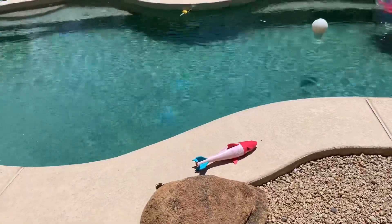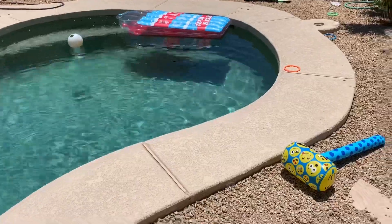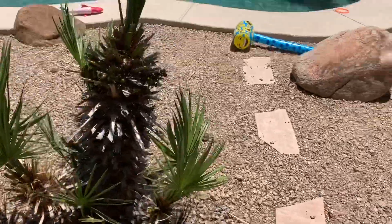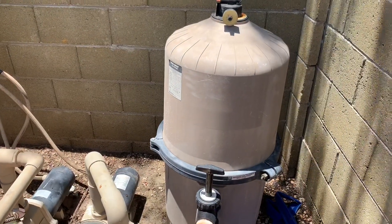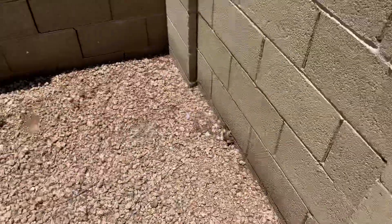One other thing to mention: when you do this, empty your baskets too. Start fresh — clean those out, get everything as clean as you can. Open up your in-floor vacuum system valve if you have one — not everyone has that. Just clean out everything as much as you possibly can. I'm going to go ahead and turn this off — it's been about 20 minutes so we should be good. Ideally clean everything as much as you can and you should be good to go. Hopefully this helps. If you like it, give me a thumbs up and subscribe. Thanks for watching, take care.